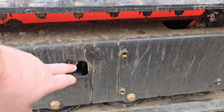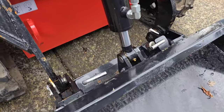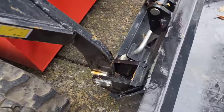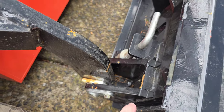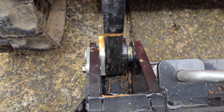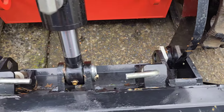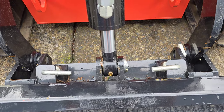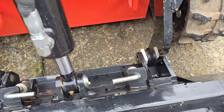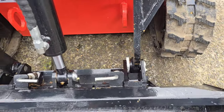This has a grease fitting right there for tension in your tracks. The bucket has a quick coupler — you can pop the two pins, take the bucket off; it's a universal plate. If you're wondering what these white things are: there was a lot of slop where the boom meets the quick coupler — they gave it a lot of space on both sides. So I took a Teflon-like plastic material, milled it down to the right size, and it takes up most of the slop in the arms, keeping your bucket somewhat centered.